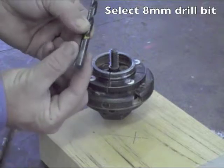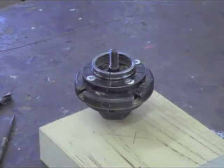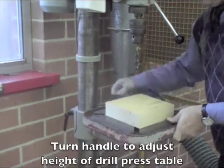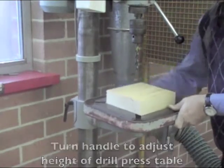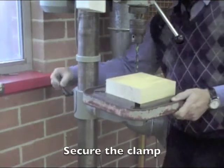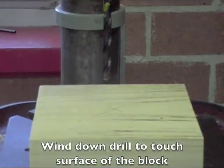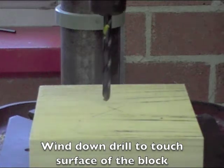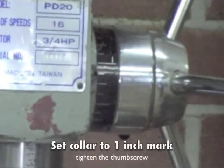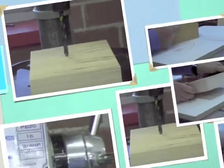We'll need to drill an 8mm diameter hole. For drilling the hole we need to raise the table of the drill press to a comfortable height, so that we don't have to pull the handle of the drill feed very far. Clamp the table in place. Bring the feed down till the tip of the drill touches the wood, then set the collar to the 3 quarters of an inch mark. We'll drill the hole after cutting the blank into a circle.